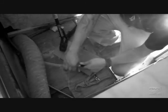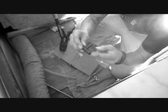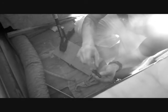All right, so now we got our two holes, one there and one there. We can run some PEX through it. Airstream bathroom. Now, I'm gonna connect a three-way PEX connection to a hotline for the bathroom sink. I'm also going to connect on this side the hotline coming from the shower that I wrapped around previously. And this is going to shoot out the hot water for the sink. And this is going to connect to the water heater.